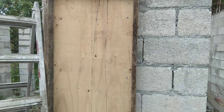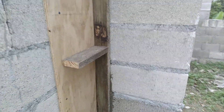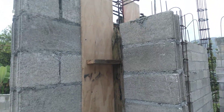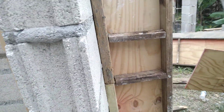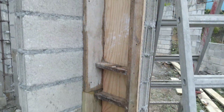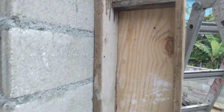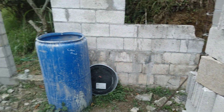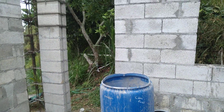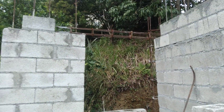We've just boxed up this column right here — it's a T column, so it goes right up. And on this side, that's it for the T column. We're going around and will show you inside where we are. All these columns and lintels all need to go up to be cast.